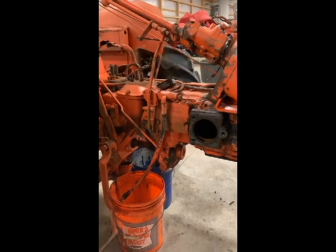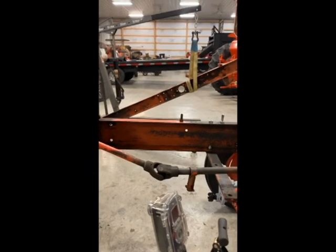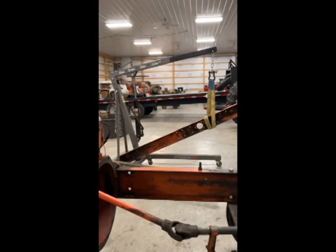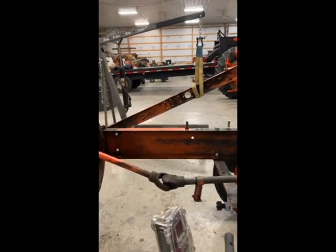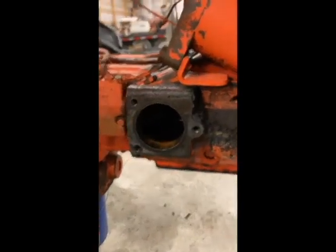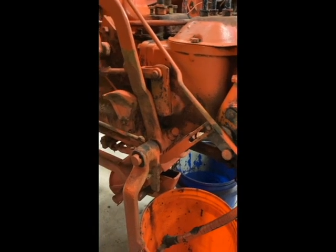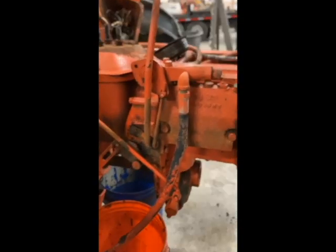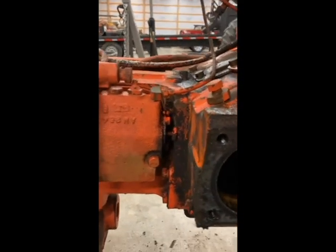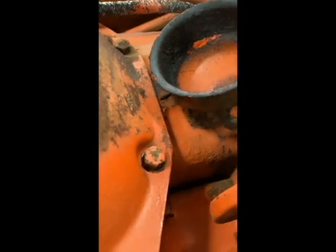I've been working for the last 15-20 minutes getting the side frame rail off. They're not all that heavy, just kind of awkward, so I like to use a cherry picker with a strap so I don't have to manhandle it and risk pulling my back. I strapped it around the front side of where the side pulley comes out, got that cover off, and we got it off. I also had to take off the brake rod and spring, which still remain on the side rail, got the two cylinders out of the way. Here is the pump - not too many bolts: these two, one up here, one on the other side, maybe one back in there.